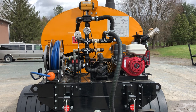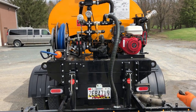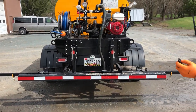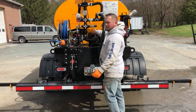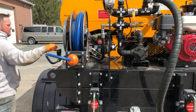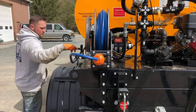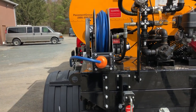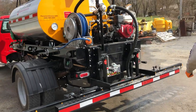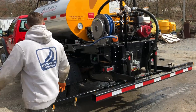We're pumping right now and the air pressure is pumping that water out of the spray bar. Now I can turn off the spray bar valve because we don't have any residual material left. I'm going to open up the valve to the sealing wand once again and allow any residual material in this line to be pumped out. Alright, that looks good — I've got no material coming out of anywhere. Now I'll close off all the valves.